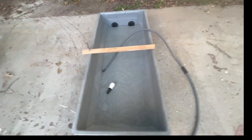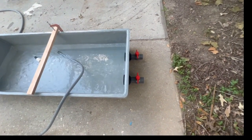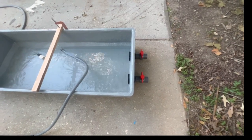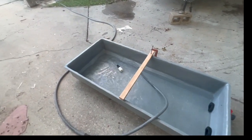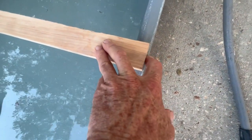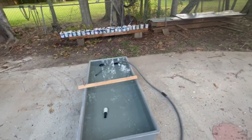We're filling up with water to look for leaks. I'm curious to see how far the sides will bow out. I needed two discharges — who knows what's going to happen in the future, maybe I'll add another pump or hookup, and it would be very difficult to add later once this thing is nasty. We are full, we are dry. The two sides together bowed out maybe an eighth of an inch — so a sixteenth of an inch on each side. That's very acceptable. That means my top doesn't have to be structural, which gives me flexibility on how I fasten it down.